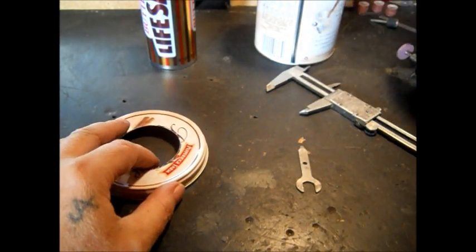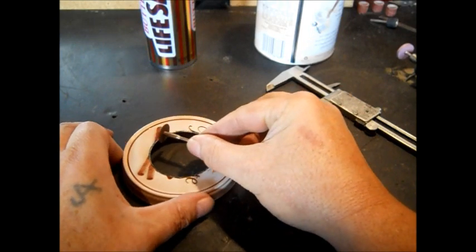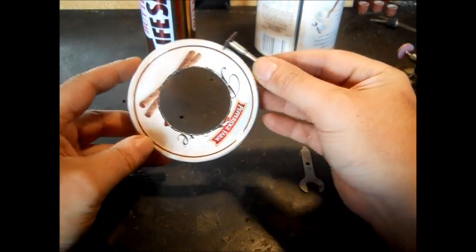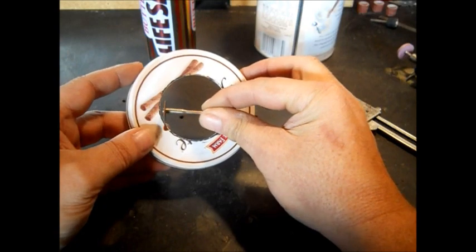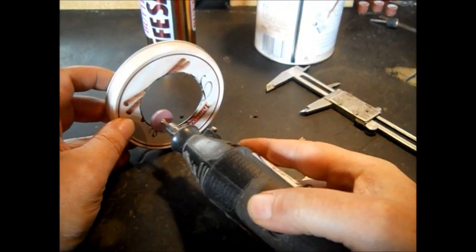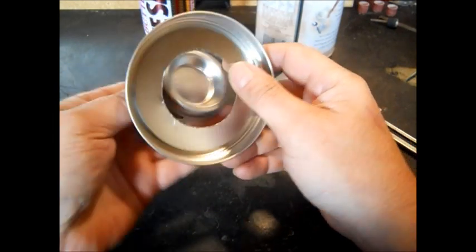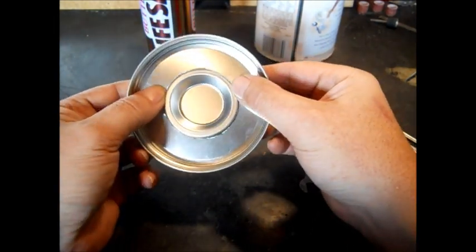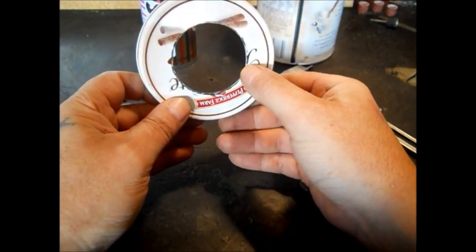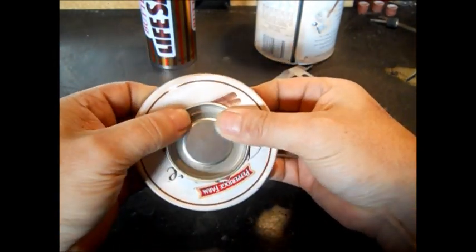When I cut this out, I used small leftover blades — I did take a picture of the Dremel liner. I'll use small blades and stay inside the circle. I used black sharpie and went around here — you can still see the marker. I cut inside of there so I would leave the mark. I always leave the mark. Then I used this to go up to the mark, and I kept testing it with the lid through the hole. If it needed a little more gone in a spot, I went right up to the line.